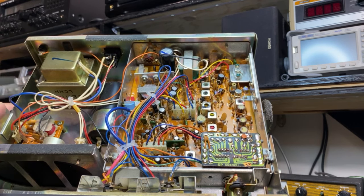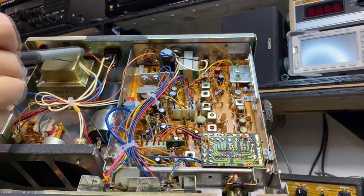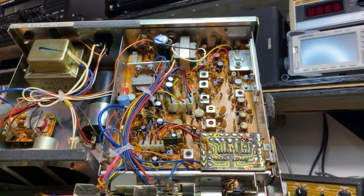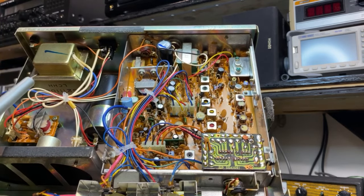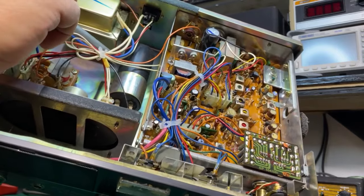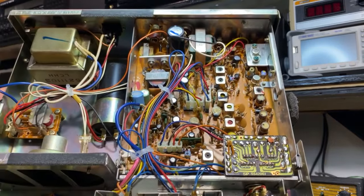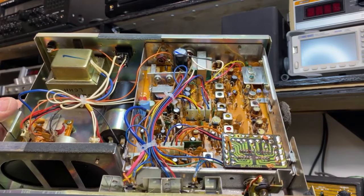So that's pretty cool. So 12 volt comes in here, it's chassis grounded. 12 volt comes in here, goes to here. When it makes the connection, it goes back into this board, which shares probably the same hookup as the output as this power supply, and bada boom, bada bing. And that's a pretty big filter cap in there. What is that sucker? That is 4,000 microfarad at 25 volts. Oh my gosh, look at that. Wow, pretty wild. Speaker set back there.